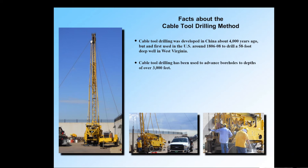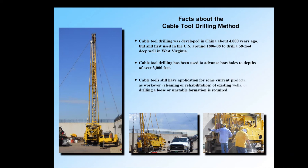They can go deep. Cable tool drilling rigs have been used for over 3,000 feet, maybe much deeper. There's probably a limit to how deep you can drive a casing, but how deep you can drill with a cable is going to be just the length of the cable, and the driller can still operate at great depths if needed. As I mentioned, there's still an application for well development. The action of that walking beam is excellent for reciprocating — you're not making a brake heat up, you're able to reciprocate with a nice stroke. It's excellent for swabbing and developing that way.